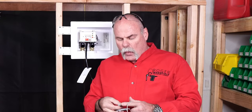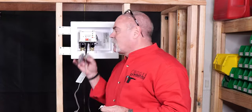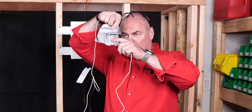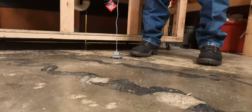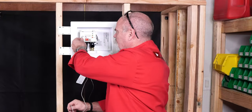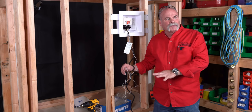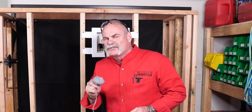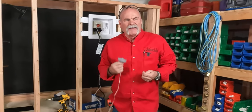This is your sensor. When water meets these two contacts, it's going to send a signal up to the unit to tell it to shut down because it's wet. I like the way they've designed this — when you set it down on the floor, the sensors sit just off the edge, so you set it up, hook it in, and place it on the floor of your laundry room right behind your washing machine and plug it into the leak sensor. Any time this picks up moisture, it acts immediately. Make sure you hang around to the end because I'm going to tell you the biggest reasons why, as a homeowner or a plumber, this is something you need to be thinking about every day.